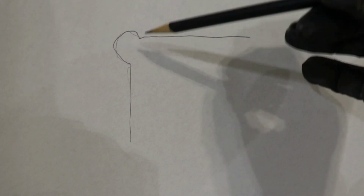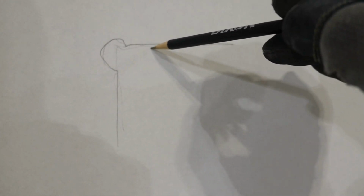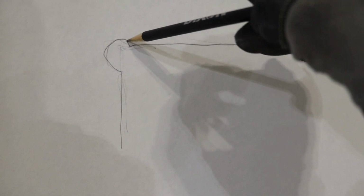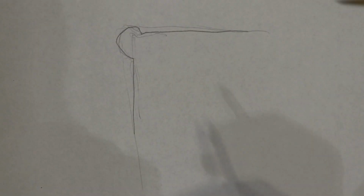What I mean by deforming the metal is it has a straight edge, then a bump here, and then another straight edge. You want to make sure that this creates a 90-degree corner. Then there'll be this little bump out, and all of that will get filled with drywall mud and make a flat surface.